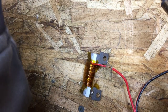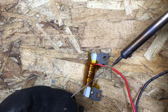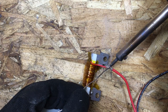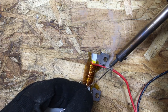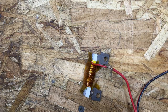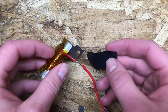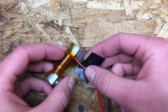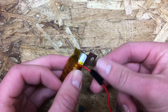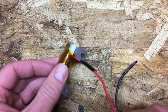You want to make sure you have a little fan running whenever you're soldering because the smoke is toxic. We're just going to heat it up until it melts and then put the solder right into the wire. And that's all there is to it for making the splice. Once your splice is done, you just want to insulate it with a little bit of black electrical tape. And that's all there is to it.